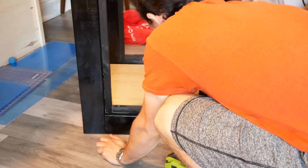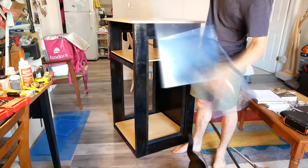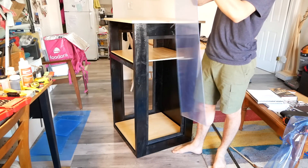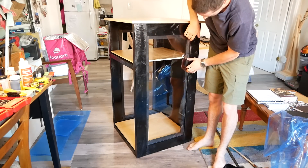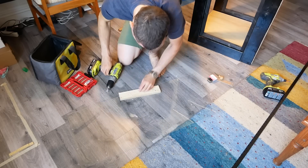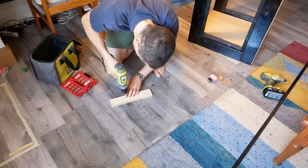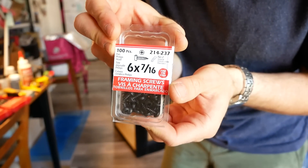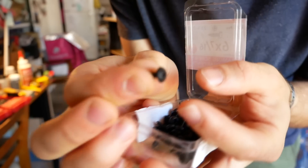For the sides and doors, I got some 2mm clear acrylic cut to size from a local plastic supplier. If you're like me and don't have a big shop, I'd highly recommend this over buying a big sheet from a hardware store and cutting the acrylic yourself. Where I live, acrylic is really overpriced at the big hardware stores and many plastic suppliers will cut your pieces to size for a very low fee. I pre-drilled holes in the acrylic and used some little black framing screws to attach the acrylic to the stops.